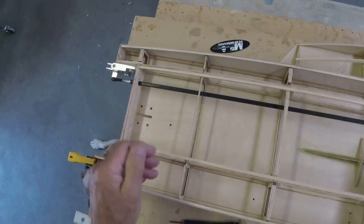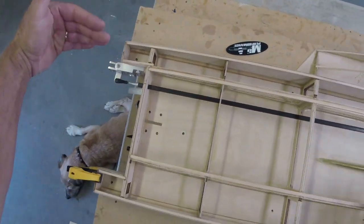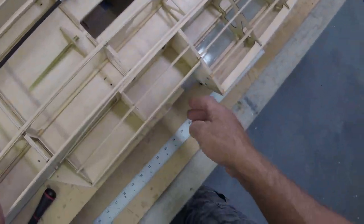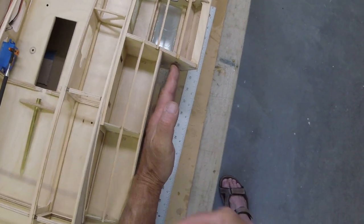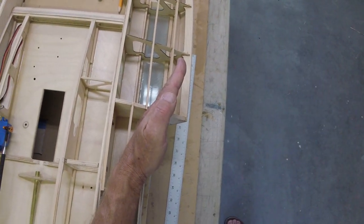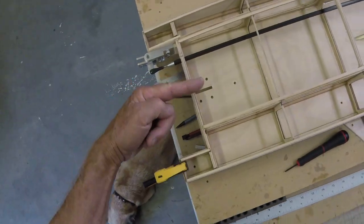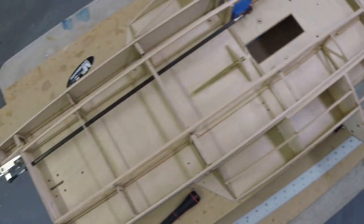You're going to predispose it when you install it. I have my rudder turned ever so slightly to the left, right? Because this boat is going to want to turn all the time. We're going to set the turn fin with a slight bit of toe out. And by out, I mean away from the center line of the hull. So the turn fin will actually be slightly, I'm exaggerating, slightly towards the inside of the course. All right, because it's going to want to turn. We're doing the same thing with our strut. Of course, we have slight angle on our strut, so it wants to turn all the time.